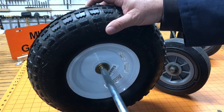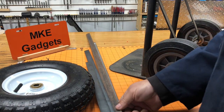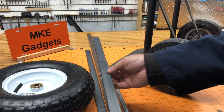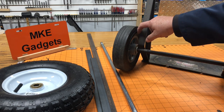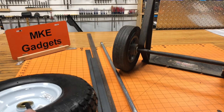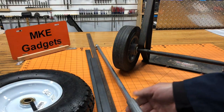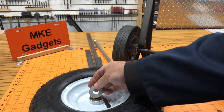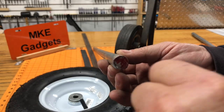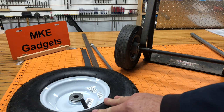So I got an axle, 5/8 inch in diameter. From my material rack I got some flat bar that's 3/16 by 1 inch — I'll bend this and weld it on. I notice there are some washers that keep the hub off the bracket. These wheels have a deep dish so I'm gonna have to have a spacer between the new wheel and the new bracket. For that I'm just gonna use some conduit I got laying around — that will slide over the axle. I don't want the end of the conduit going into the bearing, so I'll put a washer on there. To fasten the wheel to the axle I'll drill a hole and use a cotter pin, so it can be easily removed if I want to change out the tire or make any other modifications down the road.